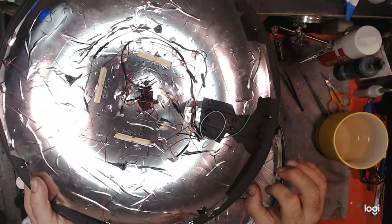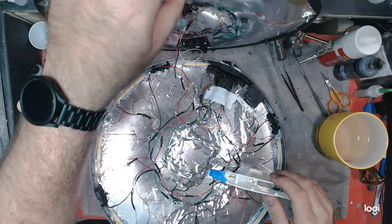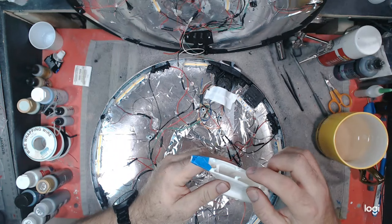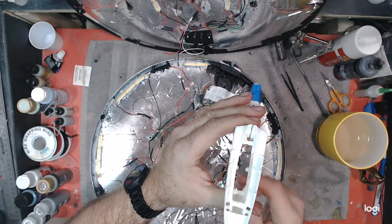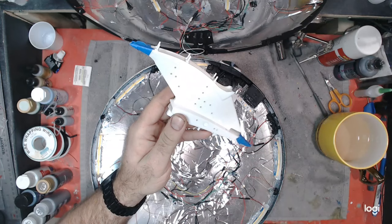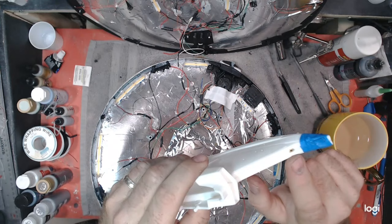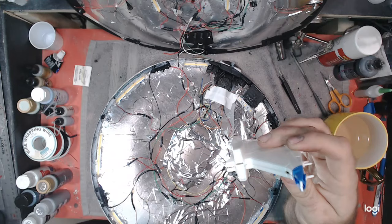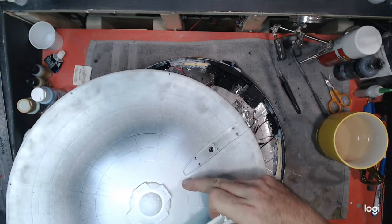I also drilled it there because that way when it comes into the neck, it'll actually drop in just forward of these two pins. You can see that first set of windows here. By dropping in at these two pins, when I pull it, it's going to come around and make that wire run straight in the area where there's no windows and it won't block anything. I've also been working on installing a piece of brass tubing in there, and I'm going to put an SMD in there. This is going to be the spotlight that is going to highlight that Enterprise registry - her logo - in the back here. I've tested it out and I've still got a little more work to do on it, but I've seen enough to know that I can make it work.